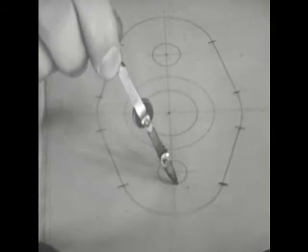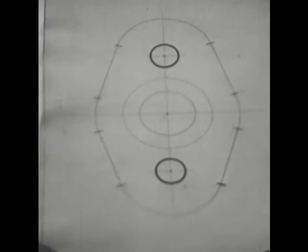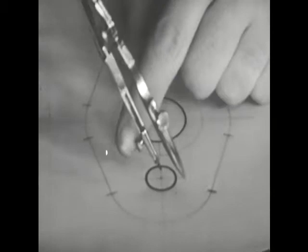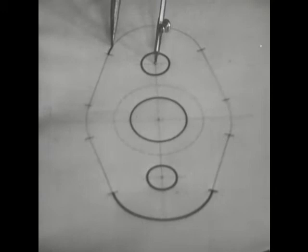For concentric circles, those made with the bow pen are drawn first, lest the pivot point of the bow pen shift around in the larger hole made by the pivot point of the compasses. Circle arcs are drawn after complete circles have been inked. Arcs of long radius follow those of shorter radius.